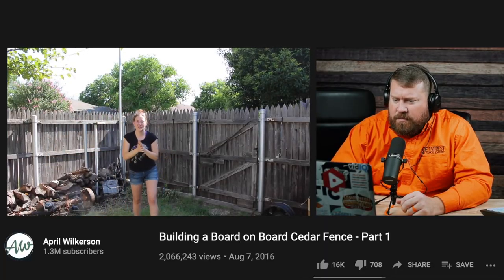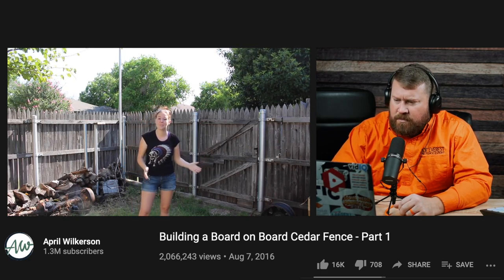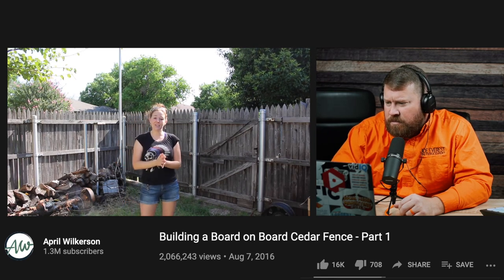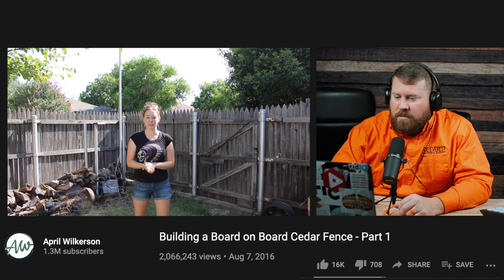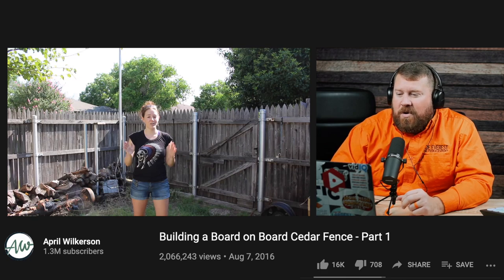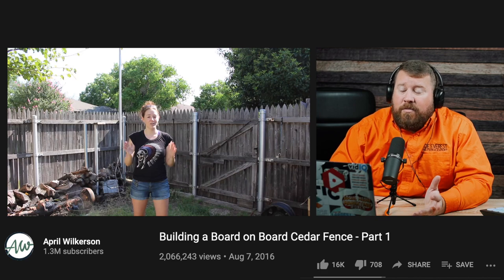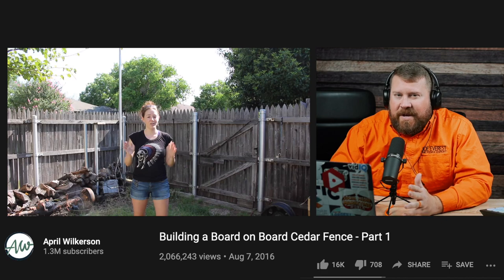Okay, a lot to do this week, so I'm just going to jump right into it. I'm going to be replacing our standard picket fence with a board-on-board fence with a nice top cap and trim. I'm going to be going with pre-stained cedar material that I purchased from a local fencing supplier, and it was actually cheaper to get the material pre-stained than it was to get the material and stain separately. So we've talked about this before — pre-staining versus staining after the fact. I like pre-staining mainly because you can really stain in around all the nooks and crannies, all the faces get stained before you put it up.